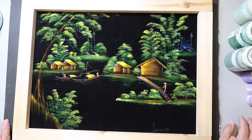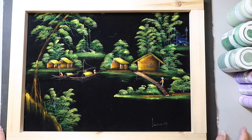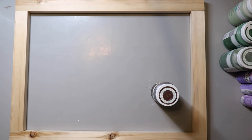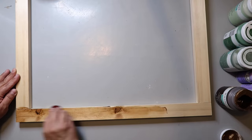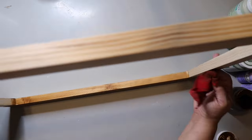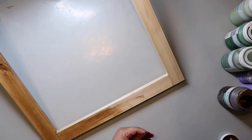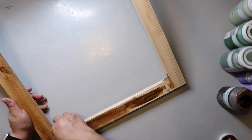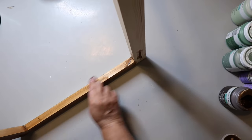Here's how it looks: I put a little bit of wood glue and then used a nail gun to put a nail in to keep it all together. If you don't have a nail gun, you can use regular nails or just wood glue and clamp it. Then I'm taking Waverly Wax in the color Antique and using it to lightly stain the entire frame — everything except the back gets a light coat.